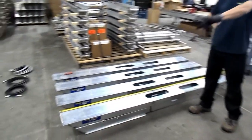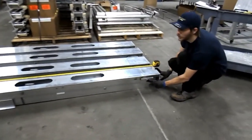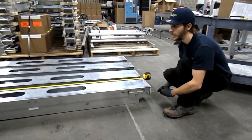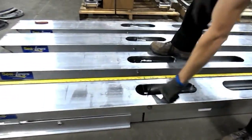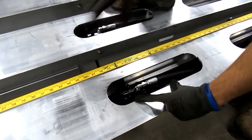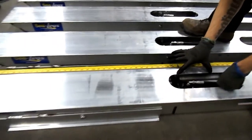I know I can run everything on my boat the way I'd like to. I'm going to start measuring out distances for holes that we're going to cut in the sheeting to mount our legs. We've got a total distance of 94 inches from one of our triples. Whenever we mount, we like to keep our rear pivot bolt within 6 inches of a cross member - it can't be any further past that, otherwise you're going to get bowing in your boat. Then we're going to look at my cylinder clearance for my hoses. We mark about 5 inches - you can do 6, you can do 7, whatever suits you. We go from 40 to 45, and this is where we're going to cut our hole in our sheeting so we can run our hoses down along.